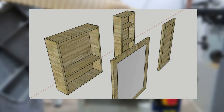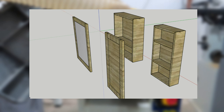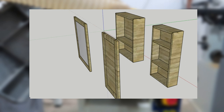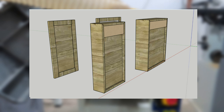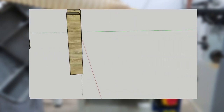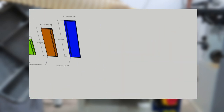So it's two bathroom cabinets built from tulip wood. They have shaker style doors — one has a mirror and the smaller one just has a panel in the middle. There's some fairly simple joinery, a few shelves to make, and on the back of the cabinets there are French cleats for hanging onto the wall. For the colour I was going to use a driftwood effect dye.